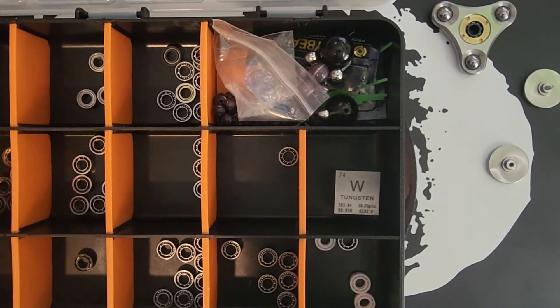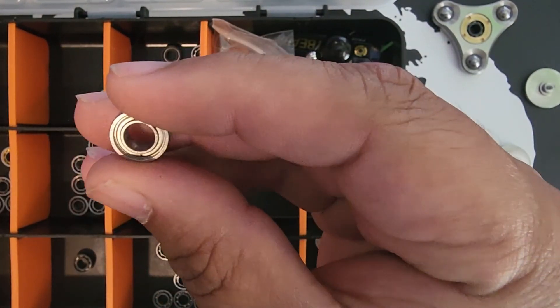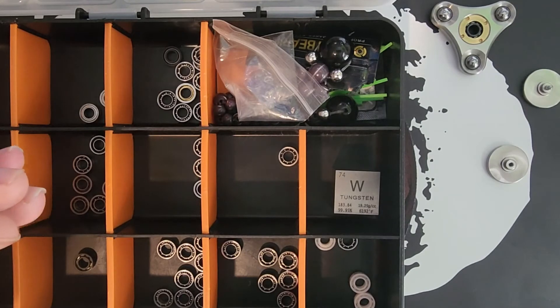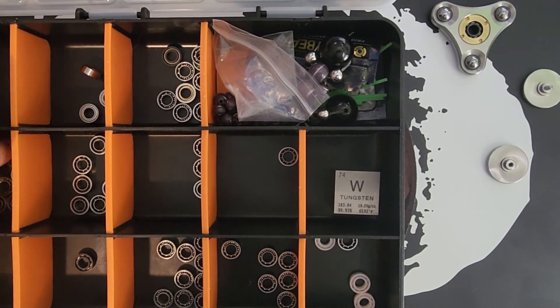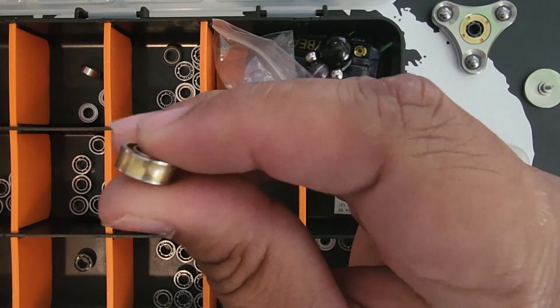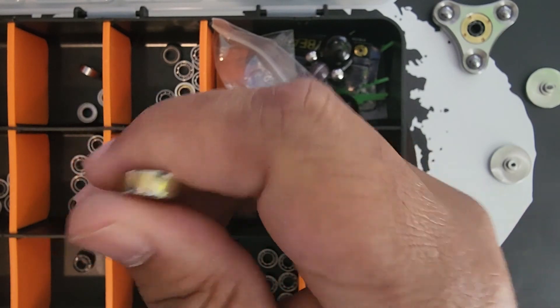In order to get this to work, you just need one of the pieces from the tool. This piece right here sits down on that — that's the right size; this one's too big so I set that aside. You put this piece here, drop your tool there on the table. If you're trying to remove a bearing, you use the smallest one. You screw this down until it's tight, make sure it's kind of lined up, then just screw down — you hear the pop, and the bearing's out. The piece that pushed through is smaller so it'll just slide through, and there's your bearing.